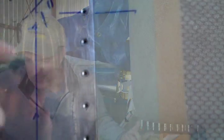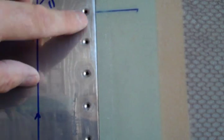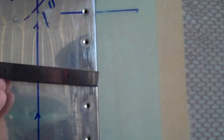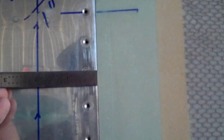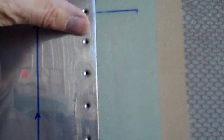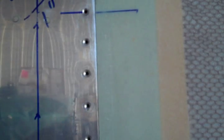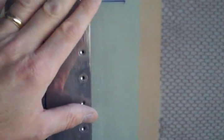Come take a look. This is the gap, which you probably can't even see — it's about a 64th of an inch, which is not as wide as it's probably going to need to be for paint, but for now it's fine. Here you can see the transition it's making with that top piece that I closed a gap on, and it's really quite nice. Once I make a uniform gap all the way down later on, it'll be quite perfect.